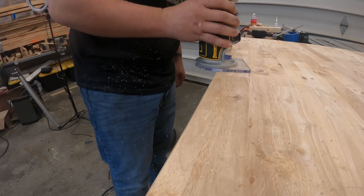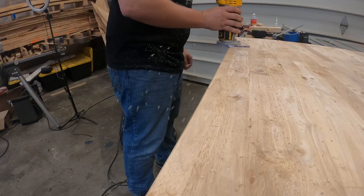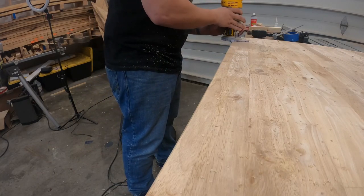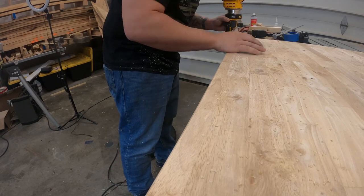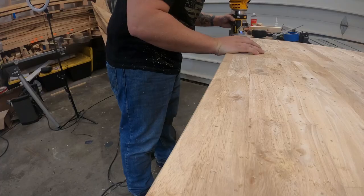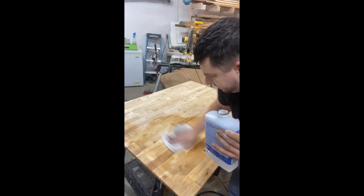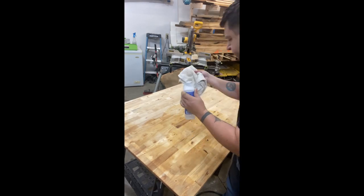Once I got to 180 grit, I used my new DeWalt palm router to give the table a slight 45 degree chamfer on the top and bottom edges. I probably didn't say that word right. Some tell me it might be chamfer. If you know or want to give me crap about saying it wrong, feel free to leave a comment.